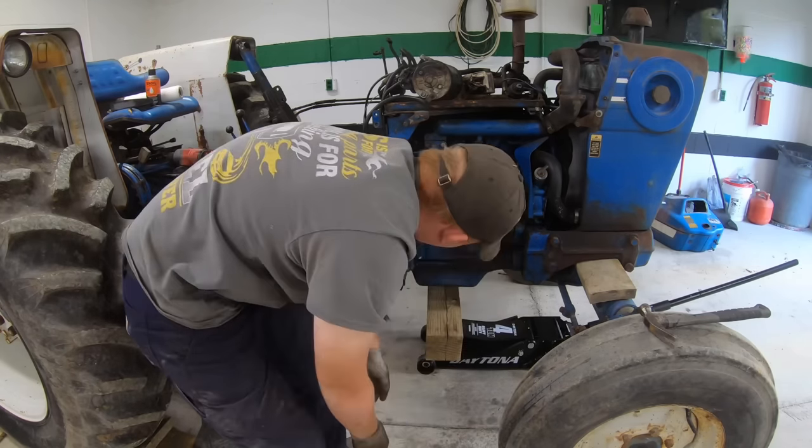Does it have a hole in it? Yeah, it's got a hole in it. That's a bleeder. And it should, because this fuel, I had to drain it out through the fuel filter, so this is empty, and that'll put a big air spot in that and create a problem, so it should gravity bleed. Oh, and there it is. All right, the rest of the fuel system should be fine.